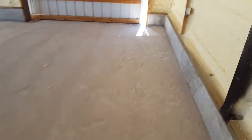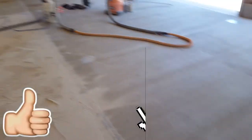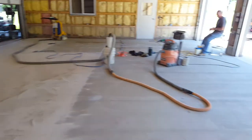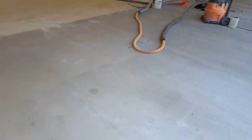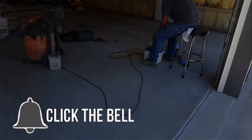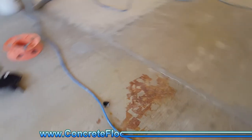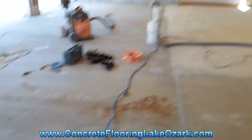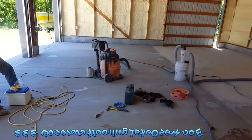It's really in pretty decent shape. We've got to do these verticals so we've got to start grinding on those. We've already done this one slab here, and as you can see we started on the second one over there, but we're gonna grind this whole thing down. We're gonna come out here just beyond the doors and hit this lip as well, and it's gonna be a black, white, and gray. We'll grind all that rust out of there, get her cleaned up, and should be ready for epoxy and chips tomorrow.